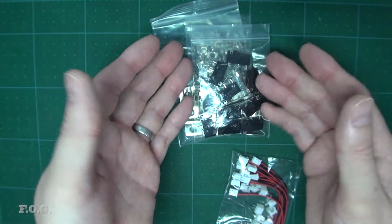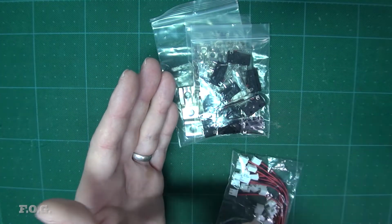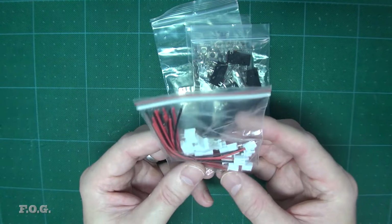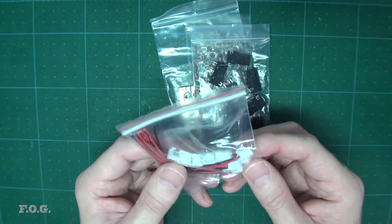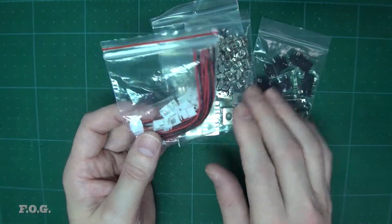So what do you need an end stop for? Well, currently as it stands, if you try to go too far off the edge, it will just keep trying to go and hammer away at those 4 little stepper motors. So it can't be good for either the controller or the stepper motors to have it grinding away on the axes. So it sounds like adding end stops is a good idea.